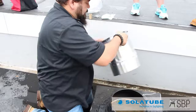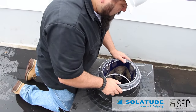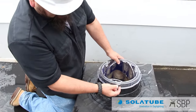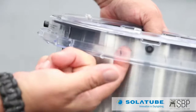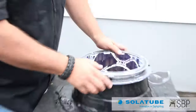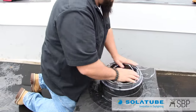That's all seamed up. I'm just going to drop this back in and find my angle again. That's about it right there — this is flush to the flashing. On the Brighten Up series, we've got a seal that interfaces with the flashing itself to make a watertight gap, so you're not having air exchange or getting any water inside the tubing. I'll drop that back down and it sandwiches in between the ring and the flashing itself.